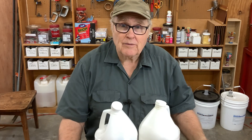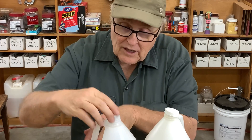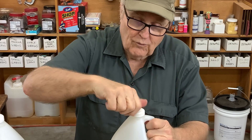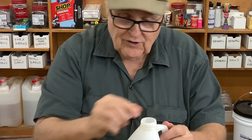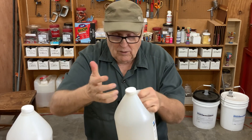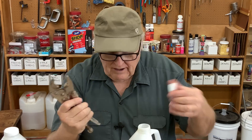The reason resin foams is that it absorbs moisture from the atmosphere. That's why you never want to come in and find your lids left open. This kills your resin worse than anything else. So make sure when you're done with each pour, seal tight. One problem with the A side is that it will harden without any B side — it'll get the crusties. If you get crusties or drips around the rim, this crust builds up and the lid gets so tight there's no way to open it. I keep a wrench that does one job in my shop: it opens the A side. Completely changed my life.